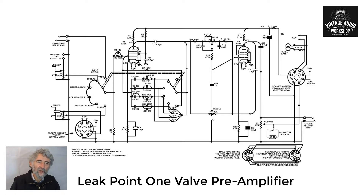That's an awkward one if you have to replace it. Quite often the circuit will work without having that tap, but sometimes it goes unstable. The main switch was incorporated into the preamp so you could put the power amplifier out of sight somewhere, and it's on the back of the volume control as is usual, and is ganged to it. Down here we simply have a diagram showing the pin to pin connection of the octal umbilical cord between the two units. With the exception of the signal lead which is coax, the others aren't — it's just a straightforward connection between the units. And then there is a separate output on a jack socket for connection to another amplifier other than the Leak, or possibly to a tape recorder.